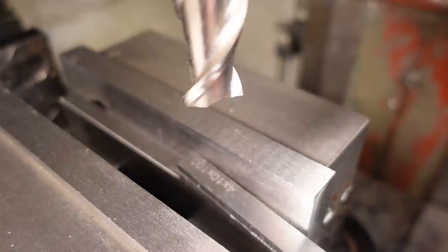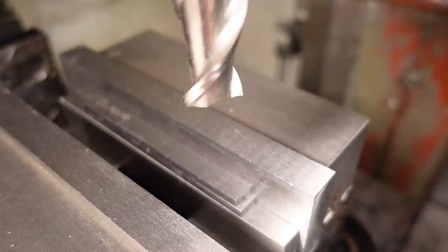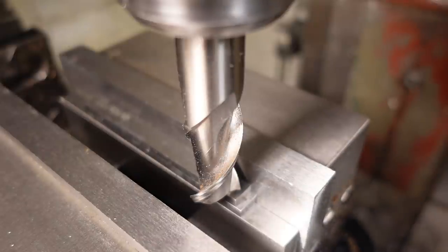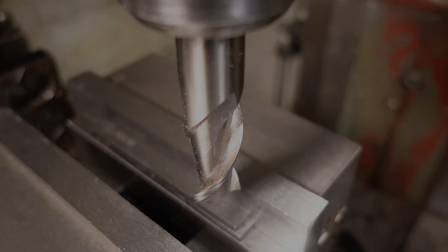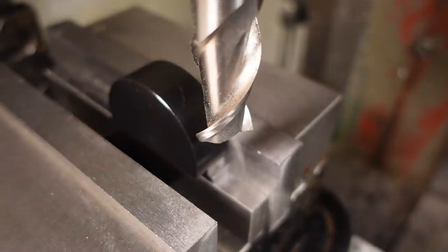A couple of extra spacers raises the workpieces up so the finish size is above the vice jaws. I'll touch the tool up on the spacers and zero the DRO. I'll pop them back in cut side down and cut them to the finished height.